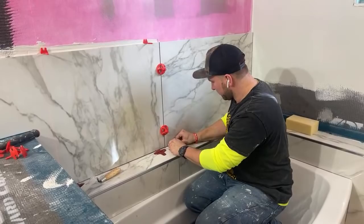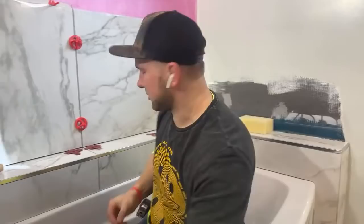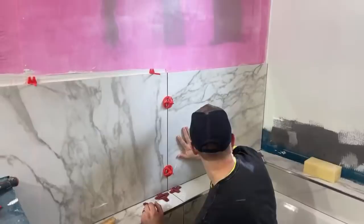Oh, come on. Can I have the little red rubies? This needs to come up just a hair, but that thing is 1/16 of an inch, and that's too much. These little ruby wedges are so clutch. They go to zero, essentially. Because this was a 32nd, and the 32nd was even pushing that up too high. So I literally just needed like right there. Now that's perfect.